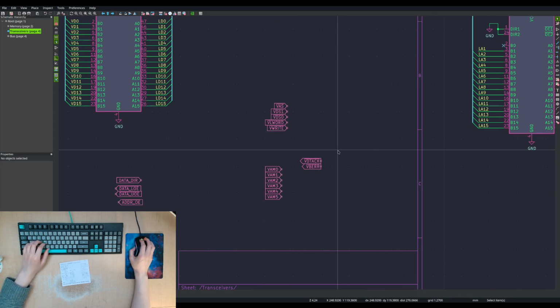What I mean is that it's maybe not needed, but now that I think about it, if you were actually dealing with a 68,000 or 68030, you could just assert DTAC as soon as the cycle starts, because the CPU will only actually complete the cycle when it can soonest complete it. So having no wait states, you assert it right away, and then it'll be 2 cycles or whatever later that the cycle actually ends, the bus request.